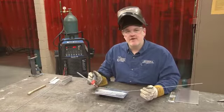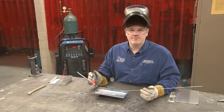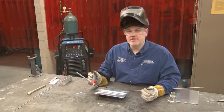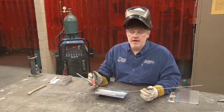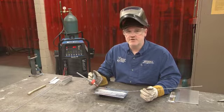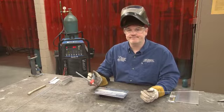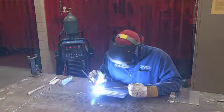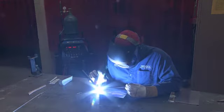Okay, we've cooled the metal down now back to room temperature, and we've set our amperage back to 120 amps. However, just because we're at 120 amps doesn't mean we're going to make the ideal weld. In fact, we can make a weld that's too cold and too hot for a given amperage because we're using a remote amperage control, in this case a foot pedal. And that foot pedal varies the amperage greatly. So now, we're going to start by not having enough foot pedal.